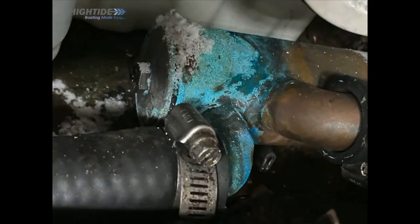Anyway, I went back to the boat. I was on that marina, and I was back at that boat, and sure enough, there's the marine plumber in there trying to redo the tops of fittings and all this sort of stuff. And I look in around the skin fitting as well, it's just fizzing. There's white sort of scungy stuff around that, and I can see that the heat exchangers are all fluffing up around their gaskets, and the paintwork is starting to bubble out. But the anodes, guess what they look like? They look like they were brand new. They just had a little bit of paint over them.